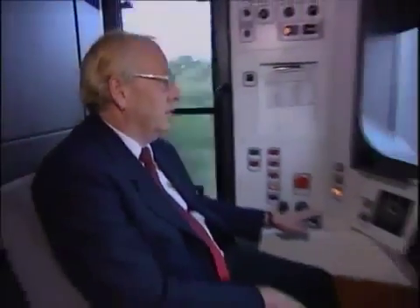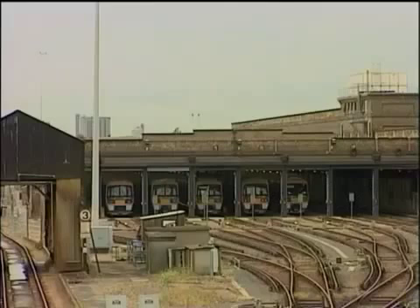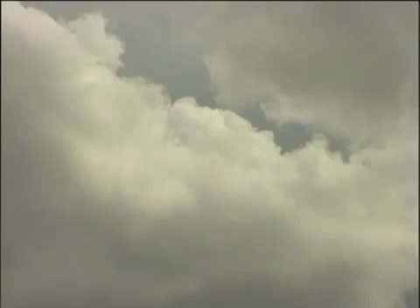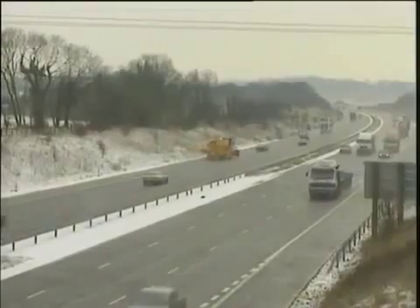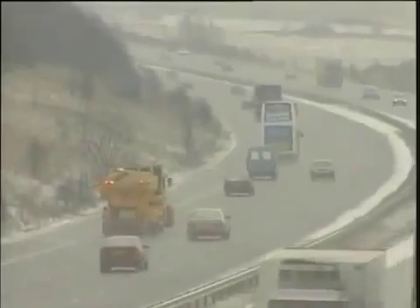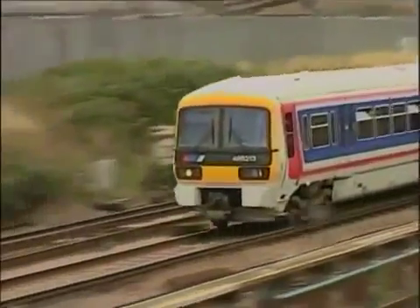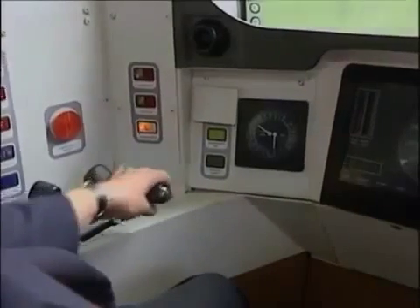But the real issue here is defensive driving. Defensive driving — what do you mean by that? I mean understanding the conditions that cause low rail adhesion, like the autumn leaf fall, light rain, or misty conditions, and knowing the locations where problems are commonly encountered in stopping. Before you take charge of your train, look at the prevailing weather conditions and give thought to how the train should be handled. It's because so many car drivers don't think about weather conditions and don't adapt their driving that so many tragic accidents happen on our motorways. Exactly the same thing applies on the railway. Look at the conditions, think about how it will affect train handling, then adapt your driving technique accordingly.